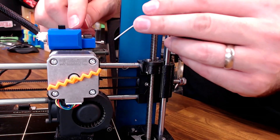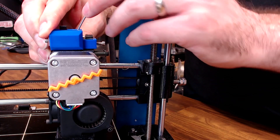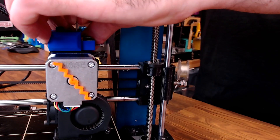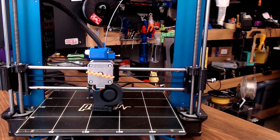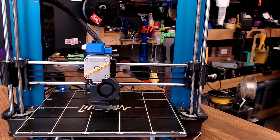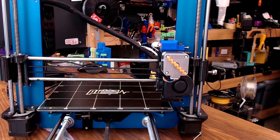You can just load the filament manually — you can actually use this whole housing to open up the extruder arm a bit. It goes right in, no issue, because it's going across that round ball. So we're printing. Filament gets cut. Sensor gets triggered. M600 gets run, we move to the front. It's able to kick the filament out without getting stuck because of that ball.